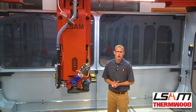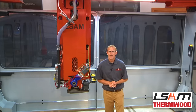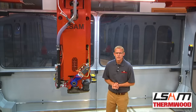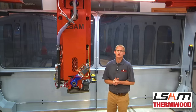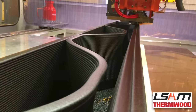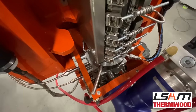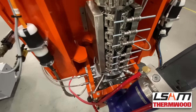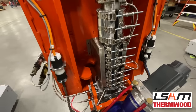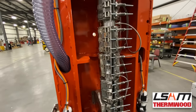The LSAM uses a patented unique Thermwood design print system called a Meltcore, which results in superior large-scale 3D print quality. This Meltcore system provides a more consistent print bead, both in temperature and flow. To accomplish this, we first utilized a patented extruder screw design that primarily relies on barrel heaters rather than the inconsistencies of shear action to melt the polymer.